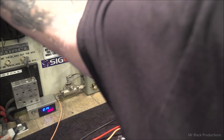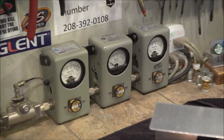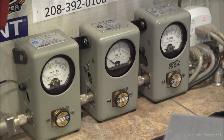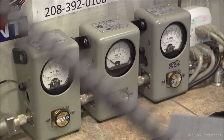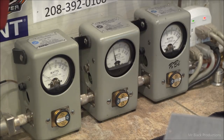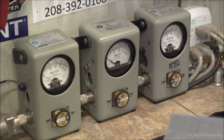Turn the amp off. Turn the 490 on. Let me show you power that's going in it. Back over here to the meters. Hello, audio. About 125 watts worth of drive gets us off the scale. And not sluggishly, like it's getting over there quick. So now we'll go to 2X. And about 1100 watts peak envelope power out of this thing.